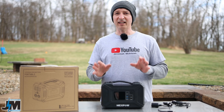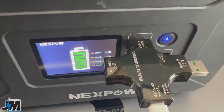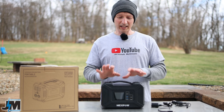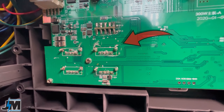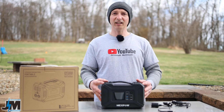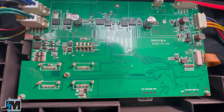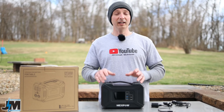One thing I want to mention right off the bat is they did send me this out for testing, and I had a really big issue with the USB-C power delivery port not working. I reached out to them, they confirmed it should work, and sent me another unit. However, I was having the same issues with that unit. So I took it apart and found some corrosion on the board — possibly from sitting for a while, since the battery was 100% dead when I got it. I scraped the corrosion off with my fingernail, put it back together, and everything is working flawlessly now.